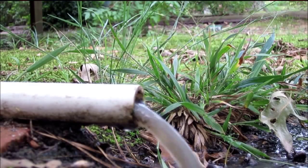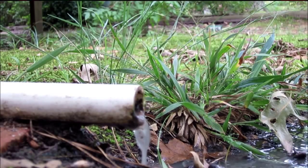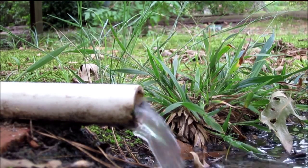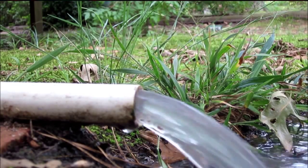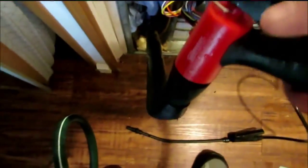Right where the coil meets that pan, there was just a bunch of stuff right there. That pan's nice and clean. Now I'm going to flush out the drain line. Evaporator's clean. Let me set up a camera outside — I'll show you what comes out of it. I'll just do this kind of gently so I don't get water everywhere. Sounds like it's running pretty clear, we'll see what comes out out there. Back in operation — nice clean coil. That'll make our charge really accurate. Drain pan's clean.